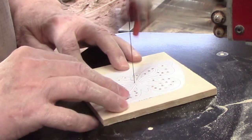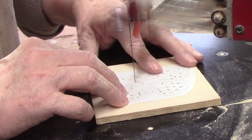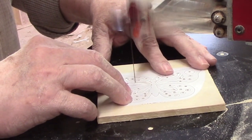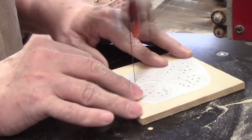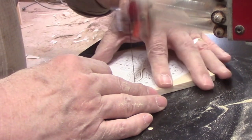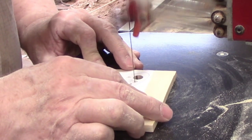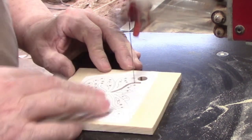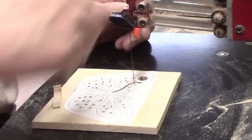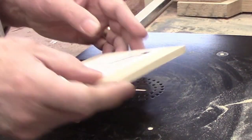There are some long shapes with pointed ends, and I cut them by going from the pilot hole to the cut line, following the line to one of the points, and then backing the blade up to the pilot hole. Then I cut down the line on the other side until the blade reached the first point where I'd stopped cutting. Then I repeated the process on the other half of the shape. I find this easier than trying to maneuver the blade through an impossible angle. The point is more likely to turn out as a curve when you do it that way.